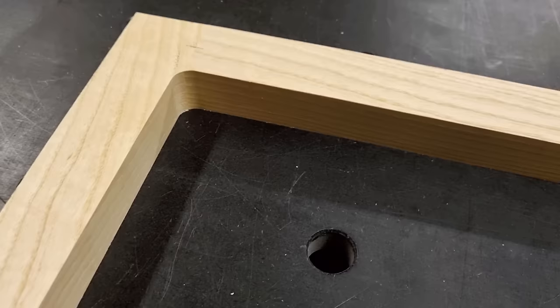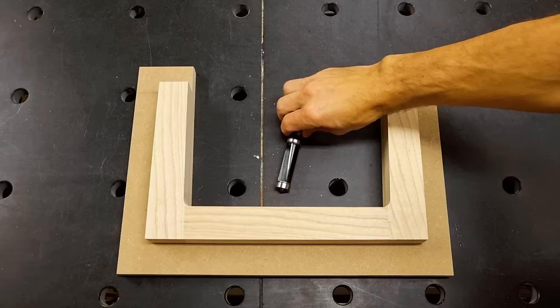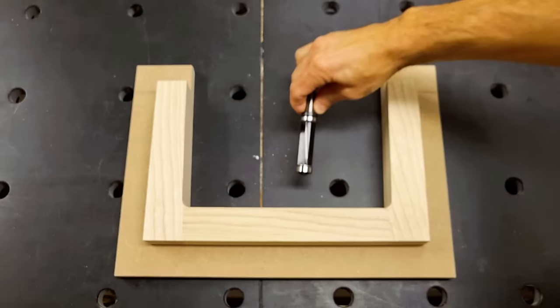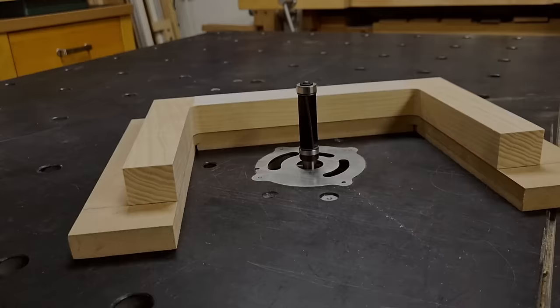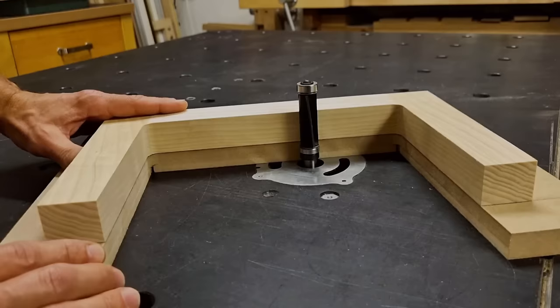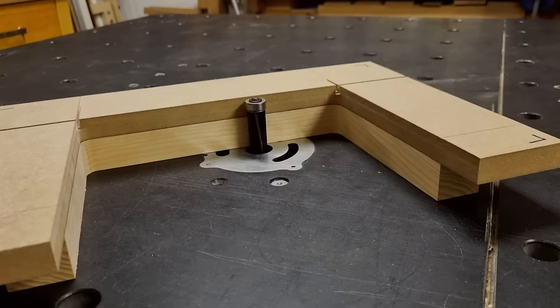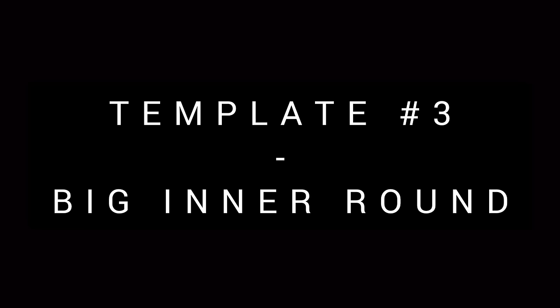Although this video is not about the routing itself, a few words: I used a spiral cutter which is quite decent at routing against the grain. But if you experience tear out when routing this shape, consider skipping the clamp option and attaching the workpiece with double-sided adhesive instead. With double-sided adhesive and a router cutter with a bearing both at the bottom and at the top, you have the option to choose routing direction and avoid going against the grain — flipping the package and lowering the cutter switches between which bearing is active and reverses the effective grain direction.